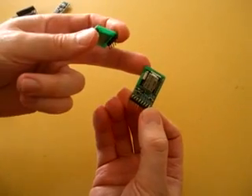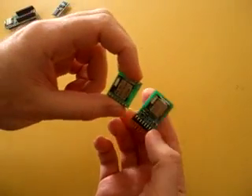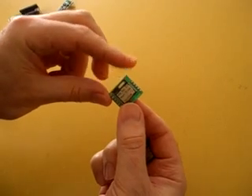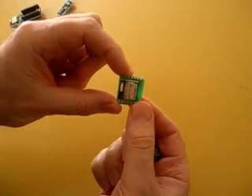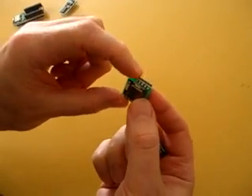The controller is on the back of the board. The RF module is on the front. The complete serial protocol is all built in. It is a seamless, lossless, 9600 baud N81 communication interface with your controller. And you have the I/O pins of the controller available over here, so you can program your application controller.